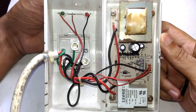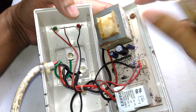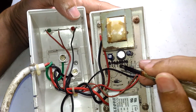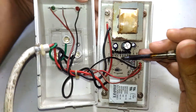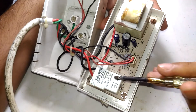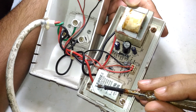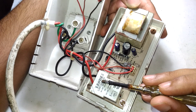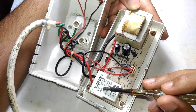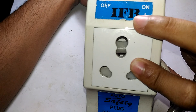Now the internals are visible. This is why the device is biased to one side — there's a seriously heavy transformer in here. I can see markings of 4.4 volts and 12.2 volts on the transformer. There are a lot of diodes, so these outputs are most likely rectified. I can pretty much confirm the 12 volts will be for the relay. The relay itself — I can't fully make out the brand name — is rated at 12 volts, with normally open at 30 amps and normally closed at 20 amps.